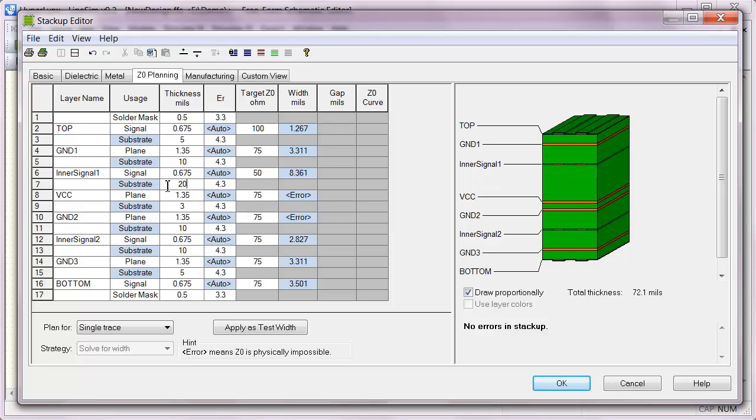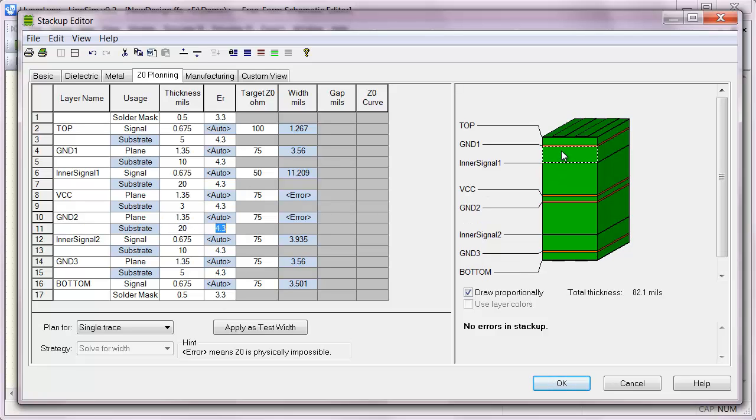That'll change the distances on the far side of the dielectric to 20 mils. Now we're more closely coupled to those outer ground planes, which will likely be solid planes — that's good. As a result we could also do a higher impedance trace; if we wanted to route a 75-ohm trace for something like video, that would be achievable with 4-mil traces on this stack-up. We've basically created a stack-up that allows for good power integrity, good emissions performance, and gives us all the right impedances we need for all our different signals.